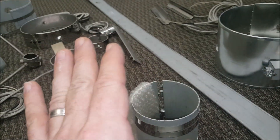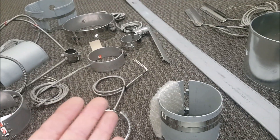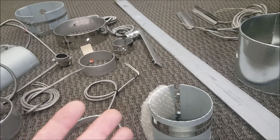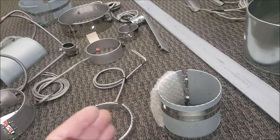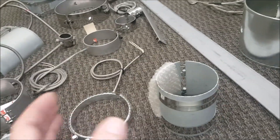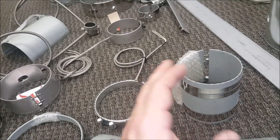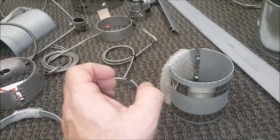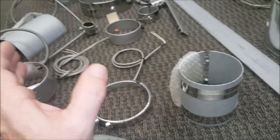Resistance elements, electric heaters — all of these are electric heaters made to heat a process: to help product from congealing, to help keep a product molten, to help keep a process warm, to prevent heat losses. With this style of heater, you can use alternating current or direct current — 120 volt, 240 volt, 480 volt, 600 volt, single phase, three phase, any of them. These are all mica band and mica strip heaters.